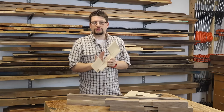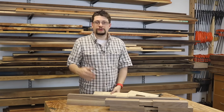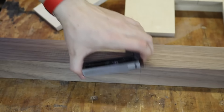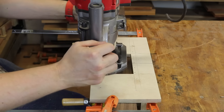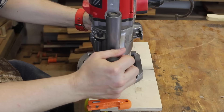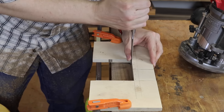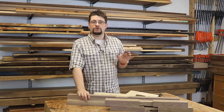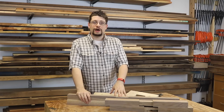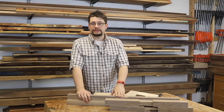What's great about these jigs is that since everything is nice and square when you make them, they're nice and square when you use them on all your pieces. So I'm able to take the jigs, follow them around the three sides of the feet, line everything up, and remove the waste with my router — only cutting about a quarter of an inch deep. Before cutting everything, I took a marking knife and marked out all the way around so I can line everything up at each of the three steps it takes to remove material for the feet. That's pretty much where I am right now. Tomorrow I'm going to start milling up the large posts that connect the feet and the upper supports.